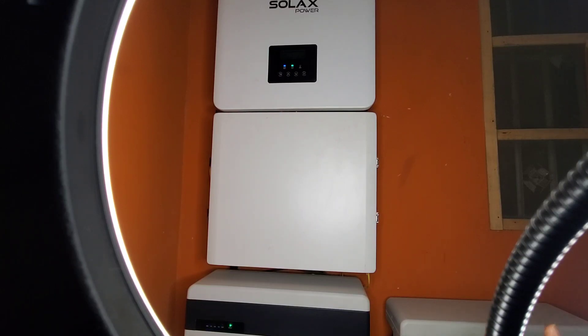I could do up to 334 volts on this system, maintaining the same battery and trying to discharge the same 30 amps. The limitation would be the inverter, not necessarily the batteries. So to summarize a few advantages: I can push 5,000 watts continuously or 6,500 for one hour.